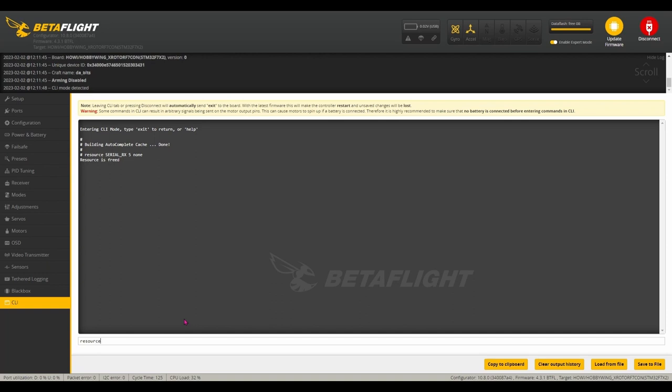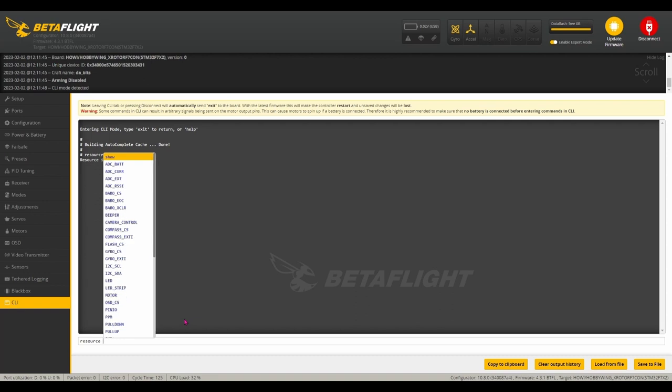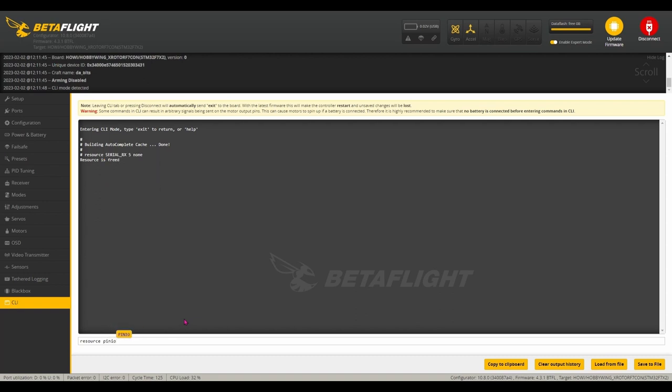So next, to assign that D02 pad to pin IO 1, we're going to type in resource PIN_IO 1 D02.